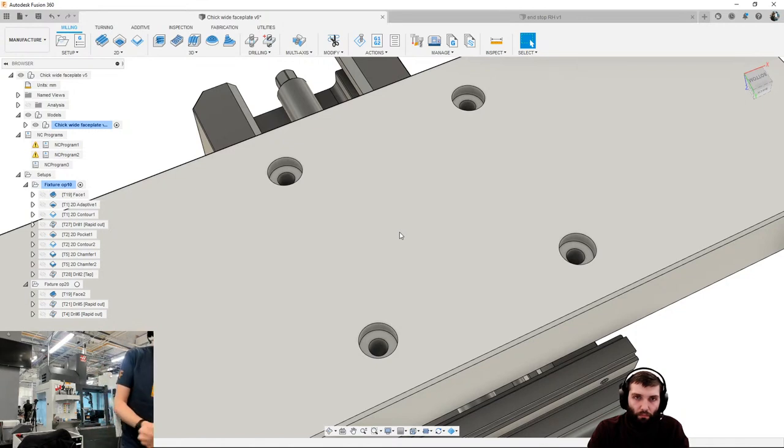So that spiral point, spiral point is a straight-sided tap where the point of it is spiraled in the opposite direction. So when it starts cutting, it hits that and pushes it down instead. Simple. Easy, nice one between the two. Spiral point, spiral flute. You've got to look at your application and go, do I want the swarf to come up out of the hole or down through the hole? Different applications call for different reasons. I'm not enough of a machinist to be able to go through all the pros and cons between them. I just know what they do.